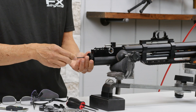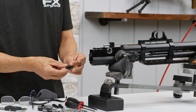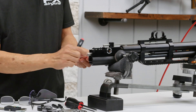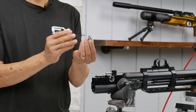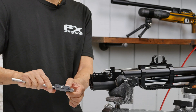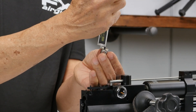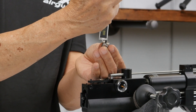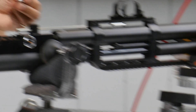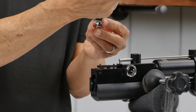When doing your adjustment you're always adjusting the screw, shooting, adjusting the screw again — so we're going to preset it to save time and show you the limitation. Here's your hammer spring adjuster. Measure the length from here to the end of the screw. Take a preset reading — the current height is 5.49mm. Taking several readings to be accurate: 5.33mm. We'll go 5.13.